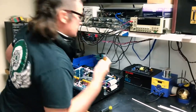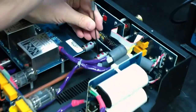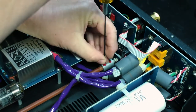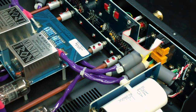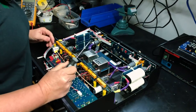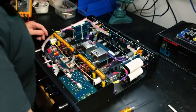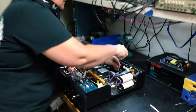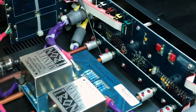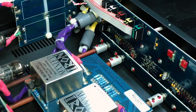Here we go with what should be a 1/16-inch hex screwdriver. We're just going to take the one loose here. You don't have to take it all the way out. Some of the couplers you might encounter in a VoxBox or Massive Passive might have a slotted screw, so you'd want a little slotted screwdriver for that. But these ones here we're just going to loosen the hex grub screw from each of these — just loosen it, don't have to take it out.